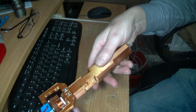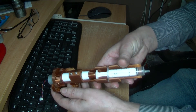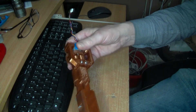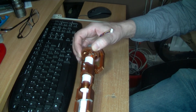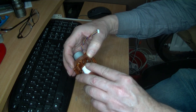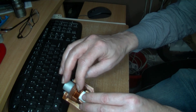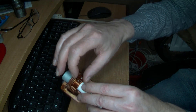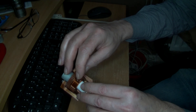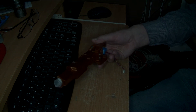Just showing the unit again — quite a nice color, this bronze PLA, non-clog PLA from eBay. Just in case I forget: when drilling a hole in here for the 2.5 to 3 millimeter bolt to grip this, use a pair of pliers — because this wheel fastens on and can come off, otherwise it might crack. I've had a couple of these crack. I'll finish off there and wait until I get my motor shield, the stepper motor shield.